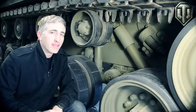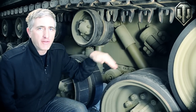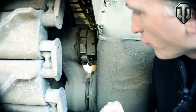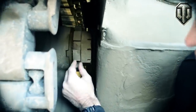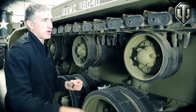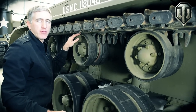Numbers one, two, five, and six arms are also equipped with shock absorbers, which reduce the rocking effect of the torsion bar suspension. The idler is also how the track tension is adjusted. To do this, you get a very large wrench and loosen the lock nut. You then take an even larger wrench and with the aid of a cheater pipe and usually two or three burly lads, you physically lever the idler forwards or backwards to change tension. Once done, you lock up your locking nut again. Track tension is checked by placing one-inch blocks on the number two and four road wheels and checking for a one-quarter-inch gap above the third.